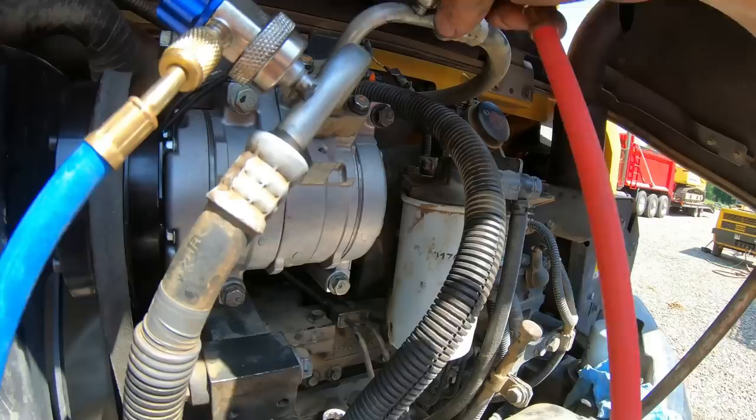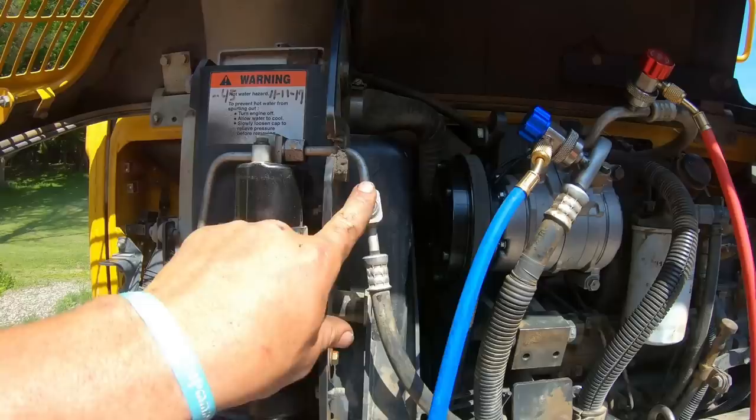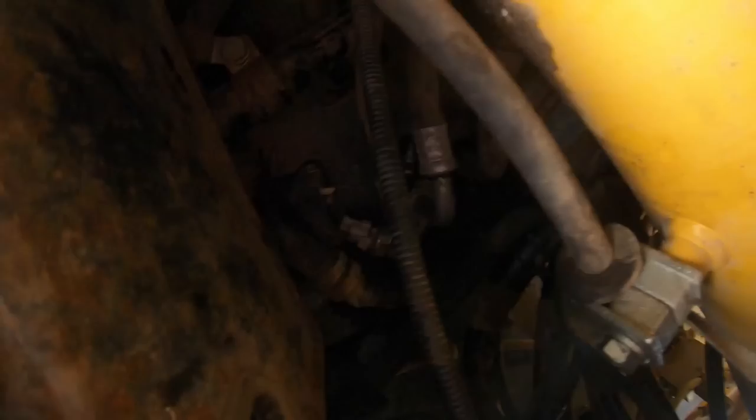Here's your high side gauge — they just clip on. Same thing with the low side, just boom boom boom. This is the air dryer I replaced. These are sight glasses where you can see and watch the refrigerant run through. Let's go down below and show what I did there before we start to pump down.